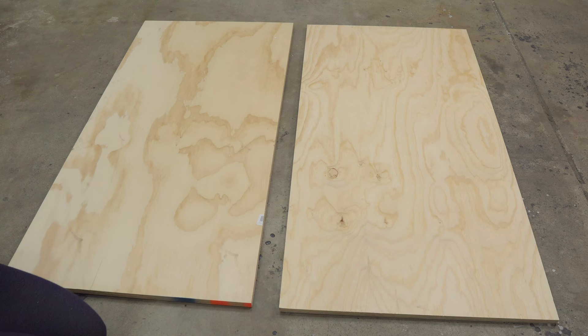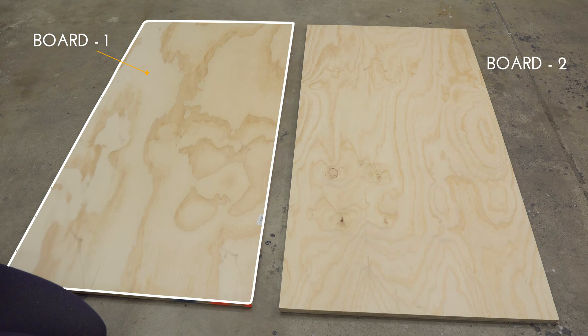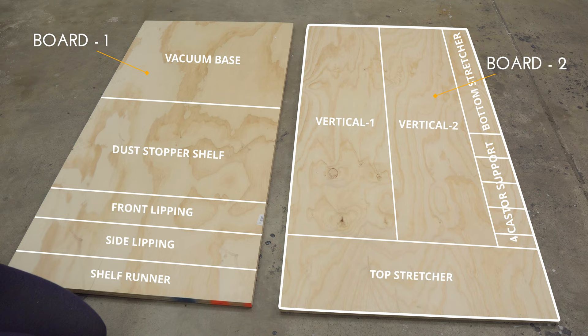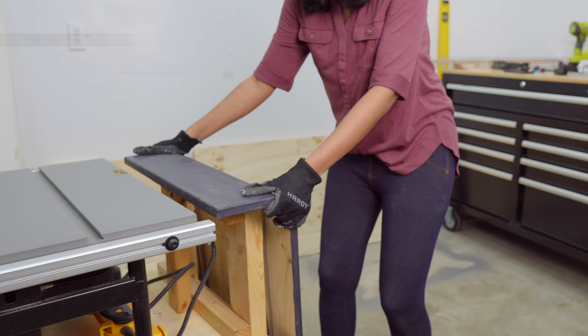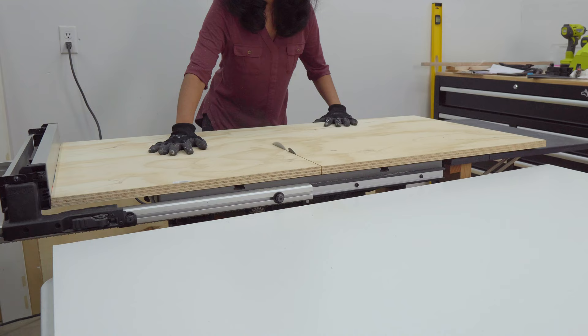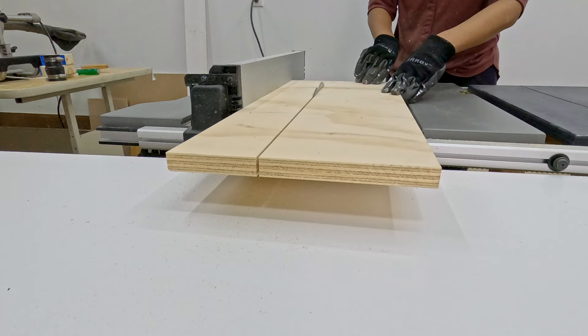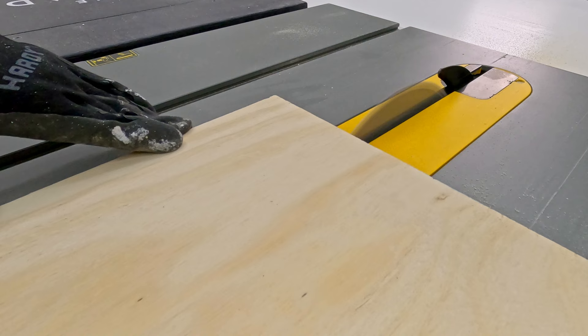To build the cart we only need half a sheet of 3/4 inch plywood. I've got two pieces here that are two feet by four feet each. On the first board I'm going to cut the shop vac base, shelf for the dust separator, 3-inch edge lipping pieces, and the remaining will be used as shelf runner. On the second board I will cut the two verticals, then a top stretcher, bottom stretcher, and the remaining ply will be used as the base for the caster installation. I have a free cut list and a detailed tutorial for this build on my website. You can also modify the dimensions to suit your needs or build it as it is — it would fit most brands. Link is in the description below.